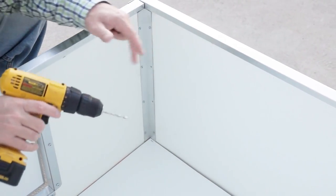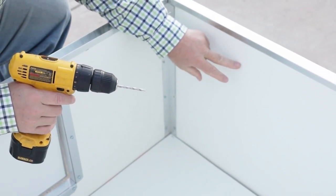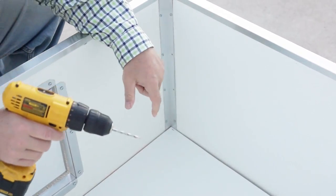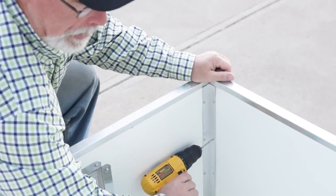The board we're using in here, both on the side and the bottoms, is called FRP. It's a very durable, odor-resistant board. It's great for a dog that can't dig at it, chew at it, anything like that. But it's going to be hard to get the screws through, so you may want to do a little pilot hole